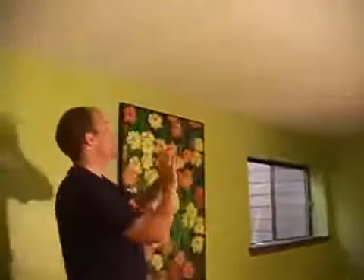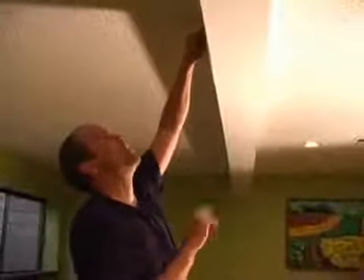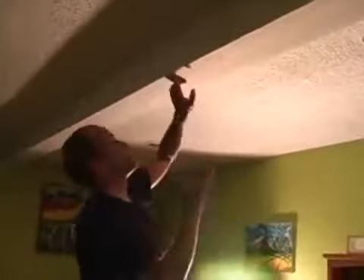Right here I really don't see anything visually at first — no watermarks, no water stains, no water damage. Correction: there are water stains right here. There's a brown water streak here and a water mark here. I'm smiling because I'm trying to do an educational video — during an inspection I try to be calm, be quiet, and then confirm before I say a word about any kind of water, before I make any deductions or conclusions about water penetration or water problems.